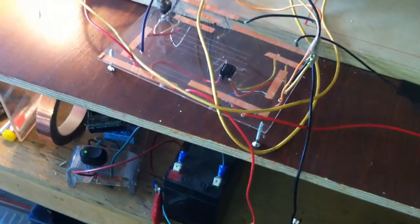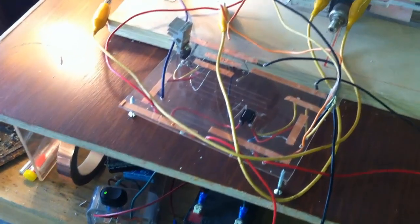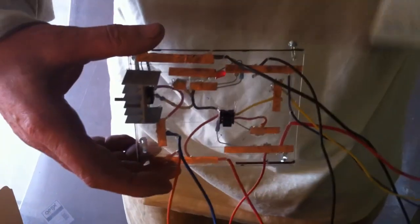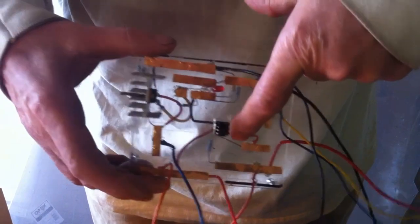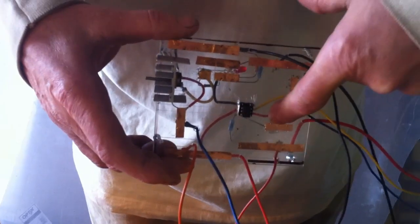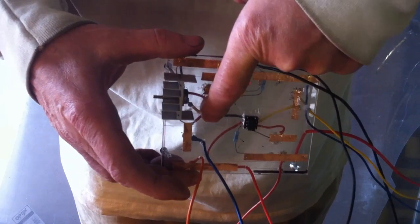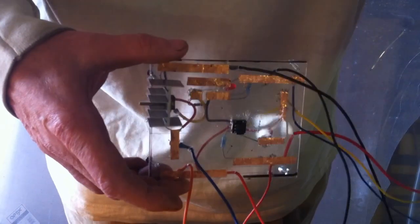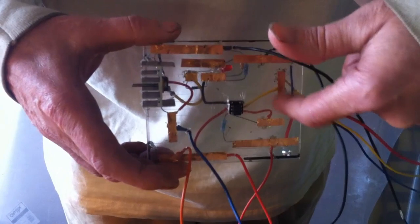I've got an induction coil going to the capacitors here and attached to a little motor here. But I want to show you the circuitry — it's only three chips. The Hall effect, which is in the nose, directly in the nose of the coil. The optocoupler, which is the key to separating the digital side from the power side, and allows the amazing thing of being able to change the power side — like changing the speed — without altering the other side at all.